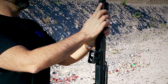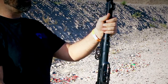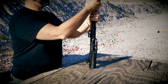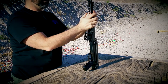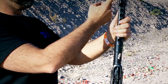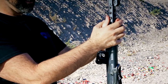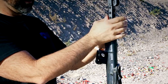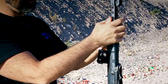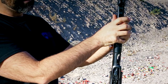Genius — they took the sheet metal piece, bent it over the front of the muzzle: to protect the muzzle for one, but also to create a compensator. Because it's wider at the bottom than the top, as it shoots and the gases come out and hit the front of that, it holds it down — keeps it in a steady position where you're already shooting. They also figured out the geometry of how far forward to keep the gun from recoiling to the rear, so it's compensating for rearward pressure and upward movement. Once you're in a locked-in position, you can dump the whole magazine exactly where you want.